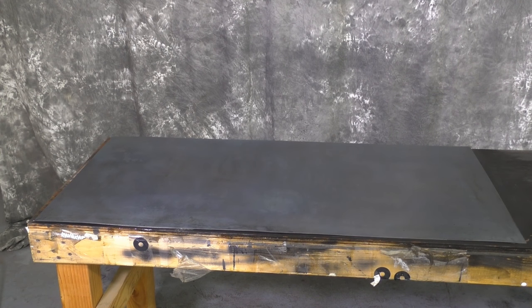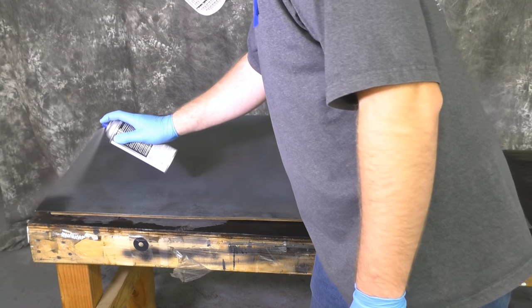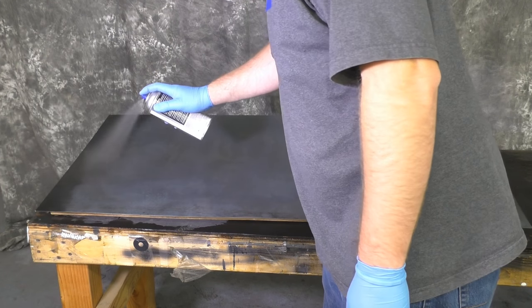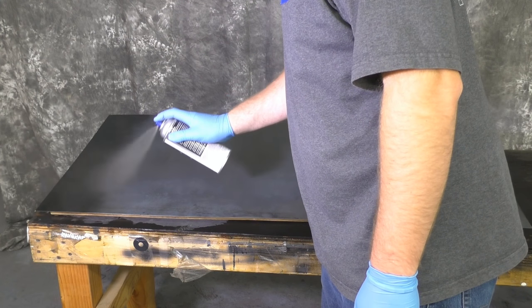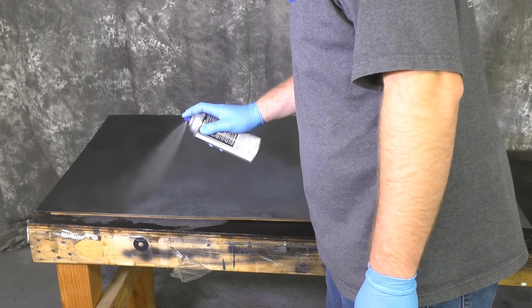After two coats of stainless black, you can see it's kind of a dark charcoalish color — not a full black. If you're wanting a full black, I recommend going over the top with the black patina stain, which is what we're going to do here. The black patina stain is essentially a tinted clear coat. If you're doing a big building, this is the way to do it — you can get an entire building looking very similar by doing a basic stainless black preparation and then going over the top with the black patina stain to finish everything out uniformly.